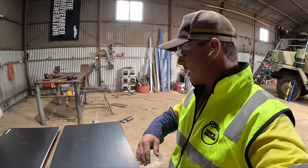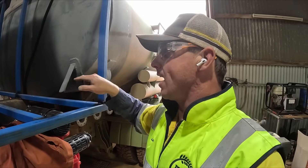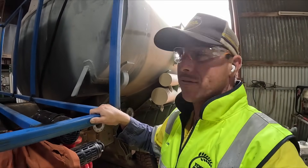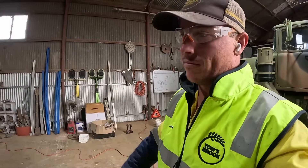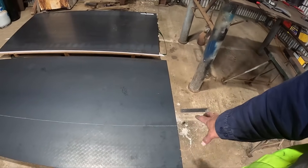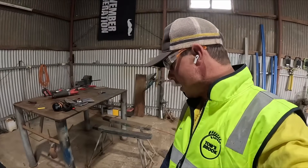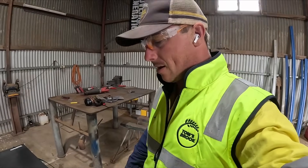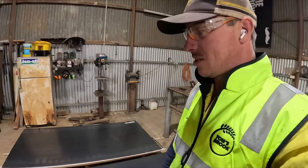I've got my line down — 83 centimeters. I did it slightly bigger than what's up there. Inside the inside where it'll be going is about 82 and a half on each side, so I've cut it at 83, and then we can just grind and chip away what we need to fit it in. There'll be 38 centimeters left over, so I'll cut that 41 by 38 and chuck that up in the steps.